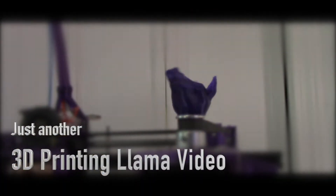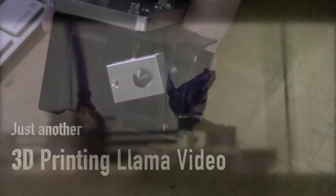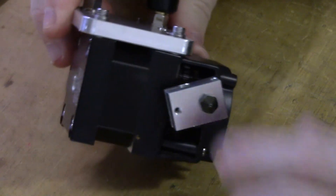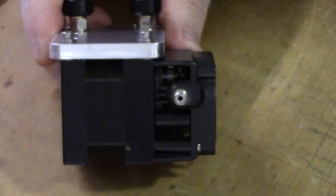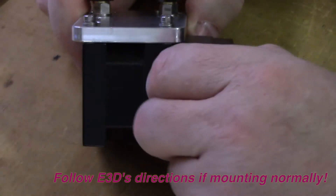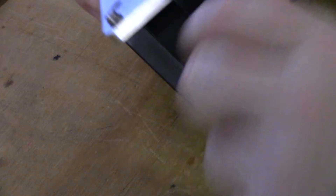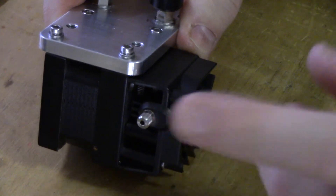Let's move the camera over to the desk and get an overhead view. Alright, I hope this is going to work — I really don't have the camera hardware to do this properly, but we'll see. The best way to do this and mount it backwards is not really to follow E3D's directions exactly. The first thing you want to do is install your heat break into the block — just put it in there hand tight for now, it'll stay. If you're going to do the thermal paste, put it on there now.